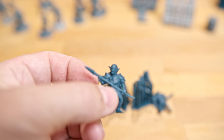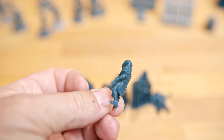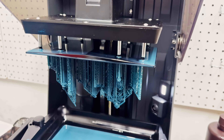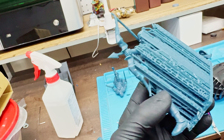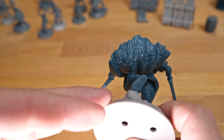Now I'm stuck making educated guesses at exposure times and validating using fully supported models, and sometimes even that doesn't seem to matter. For example, I dialed in a 2.2-second exposure using Frozen Aqua Hyper Detail resin on standard 32-millimeter miniatures as calibration models, but when I printed a plate of 75-millimeter collectible models with the same settings they were so over-exposed that the support trees fused together, and removing them caused serious chip-out on the model.